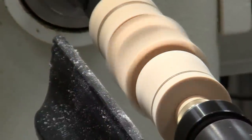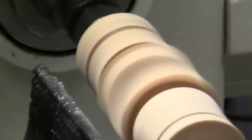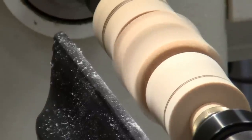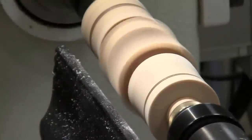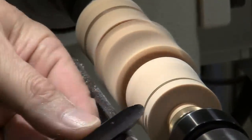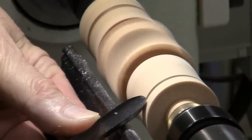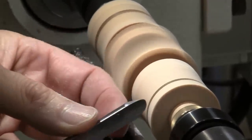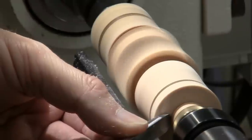Don't touch that for a while — it's hot. Now we'll round them over. We'll start down here because that's the easiest one. I'm going to come in and ride the bevel. The motion is to get the bevel cutting and rotate it around to get the cut. When you come around the corner, swing the handle around — you need the bevel riding the contour you want, and you need to end up with the point going directly toward the center.